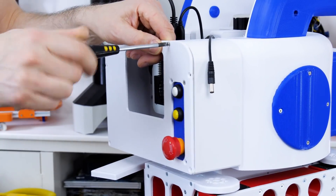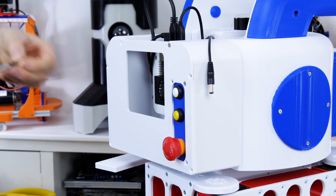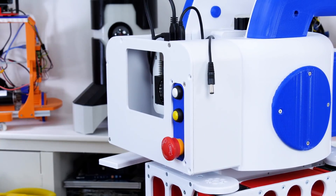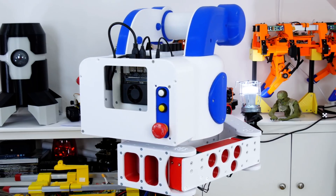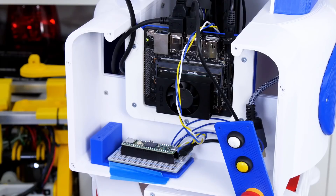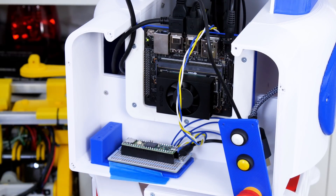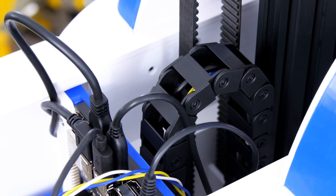There's a back panel which has a control panel on it with an emergency stop switch, as well as two activation switches — one to activate the ODrive calibration for the wheels, and the other to home the linear axis of the head and body that moves up the V-slot extrusion. For now I've left a big hole so that the Xavier can vent its air and I can keep an eye on it. That looks okay all together; it follows the contours of the back of the head and gives us a boxy enclosure to put all the electronics in. I've temporarily mounted the Teensy with blue tape, and I've extended those serial wires all the way to the bottom — using unshielded cable for now, which seems fine. Those cables go down the cable track that neatly folds away as the head goes up and down.